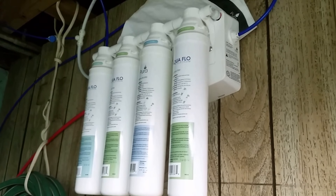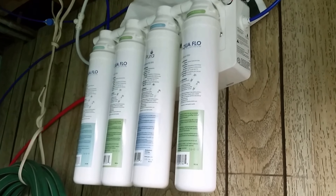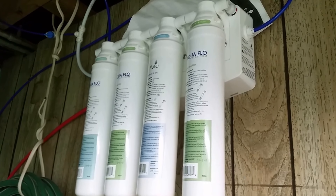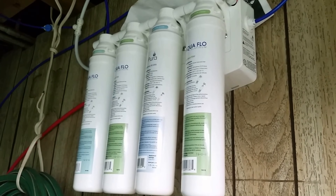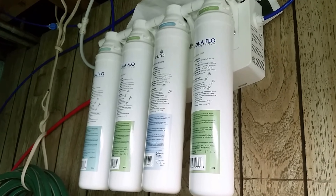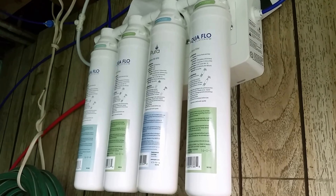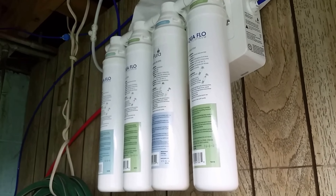This system, or any other basic RO system, will remove 90 to 95 percent of the total dissolved solids in the water, so what your starting water is will determine what your finished product is. The way this filter works is not like those filters in an iced tea pitcher where you pour a gallon in and wait for it to drip through. This has water pushing against fine filters, and it also has water pushing past them, which removes all the stuff that doesn't make it through — so it's kind of self-cleaning as it goes. But what you wind up having is this little hose that comes over here and goes down the drain.